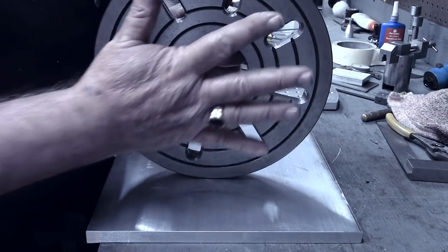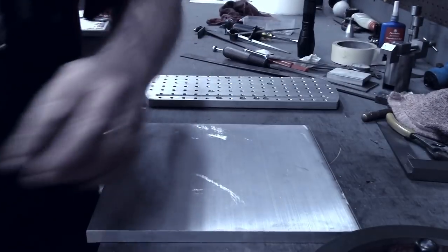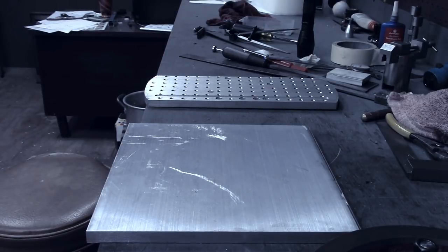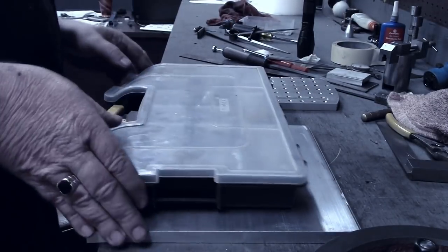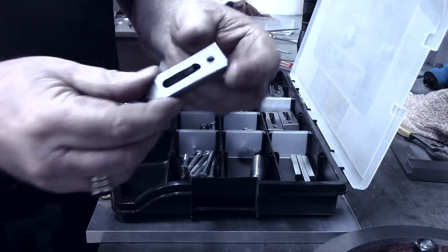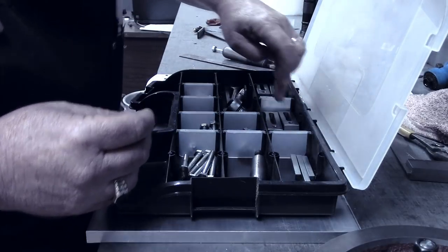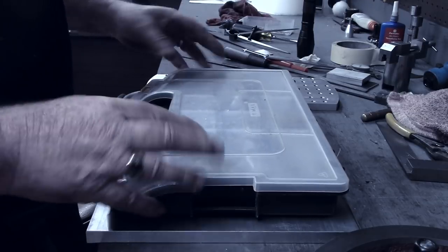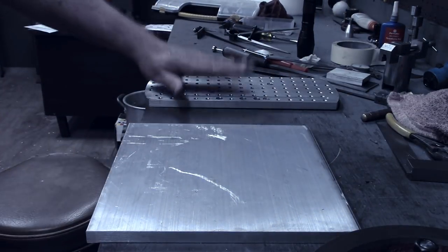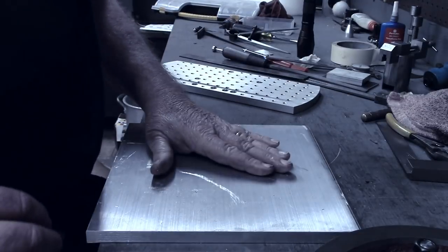That's one of the things that made it difficult to bore. With a pallet on there — even if it's all centered — I've got plenty of space to bolt some counterweights. I've made a good supply of hold-down toe clamps. I've got 12 of those made up, so I feel it would be much simpler to hold something off center on the lathe with a tighter bolt hole pattern and also easily mount counterweights.